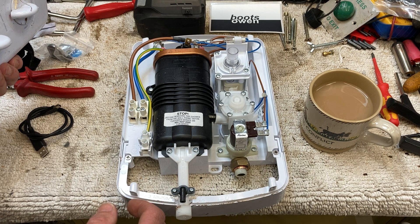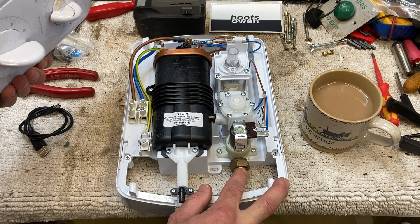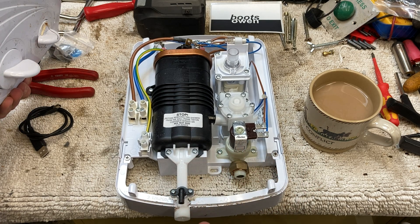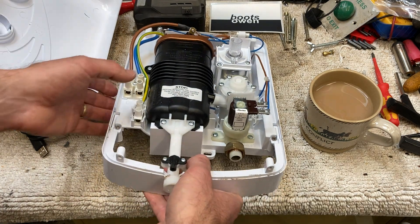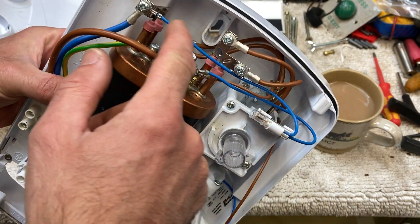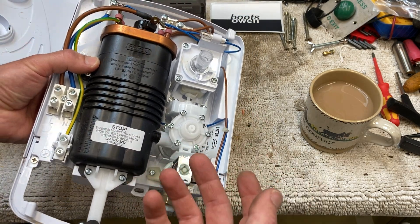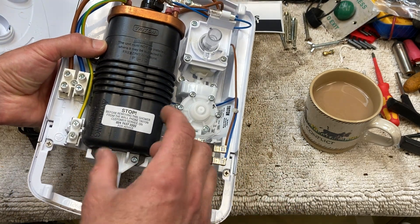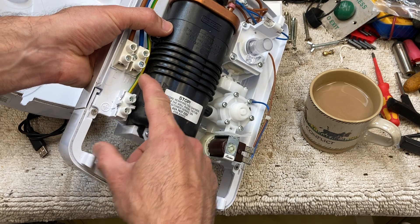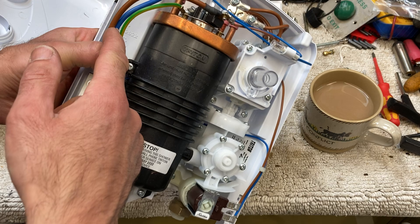What are you going to do? In fact, it's so clean that apart from the olive on the pipe down here — the copper olive on the inlet — I would go so far as to say it may not have been used. I've seen showers in the past, and you've seen videos on my channel, where the cables coming in are burnt and overheated. I found some heavy shower cable, and the last ten centimetres that would be in here was completely crusty and cooked, which is amazing because they were probably a bigger gauge than that cable.